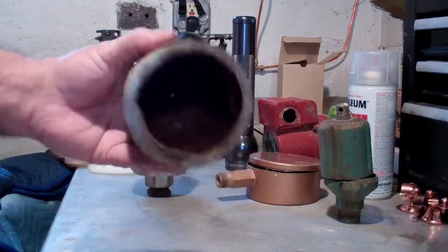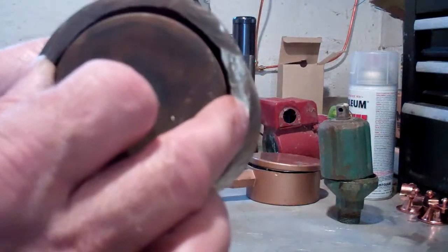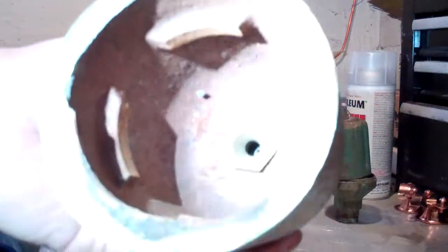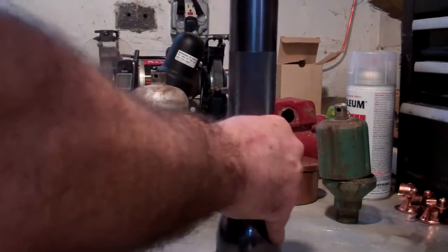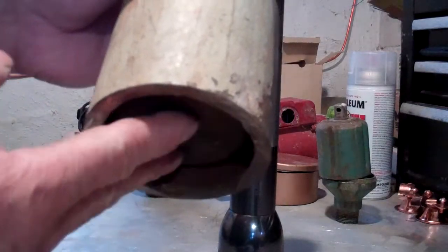Once it dimples out, it drives itself off the diffuser plate, and when it drives itself off the diffuser plate, it goes into the socket. Let me illuminate that socket with a flashlight. It's basically just a concave socket at the bottom, and you can see these cast-in guides around here that keep the cylinder in alignment as it moves up and down.